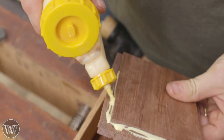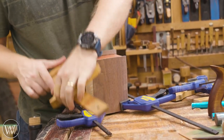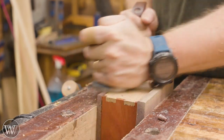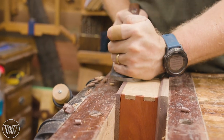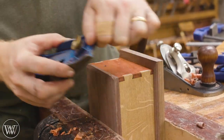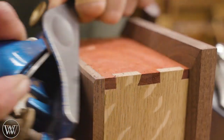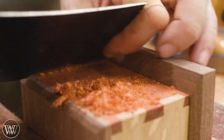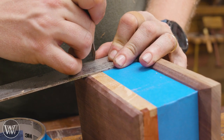You can see how this will just stick down in and it will overhang a little bit right now, and once it's done we can come back and plane all that off. You can never have enough clamps — I've got a whole pile of different clamps. Then we can bring the plane in and plane it off smooth to the edge of the box, just being careful not to blow out. You can see there's a little bit of the padauk I blew out there going a little far. On the end grain it's easier to bring in the low angle plane and run across with that. Then I'm going to chamfer this down so that one edge of the chamfer meets the very top of the box and the other edge comes in the same amount as it did on the other side — just an even chamfer all the way around. Then we can bring in the card scraper and make sure that everything is nice and flush; if there was any tear out from the plane, the card scraper will take care of that.